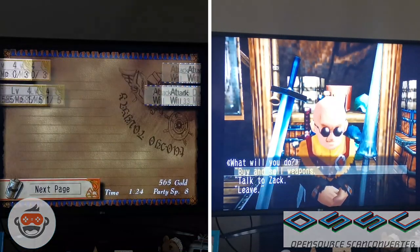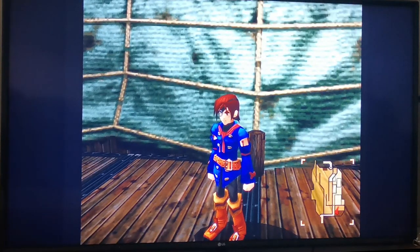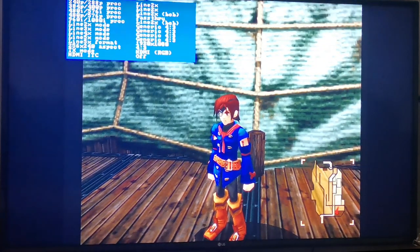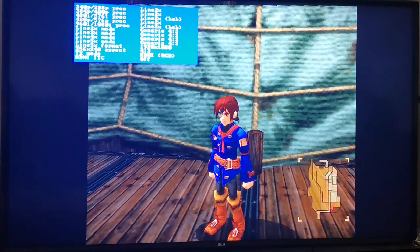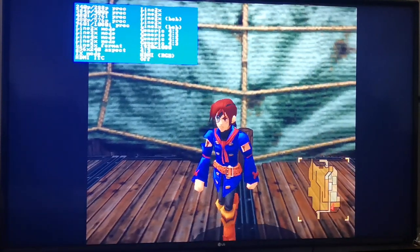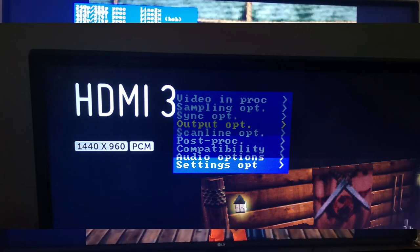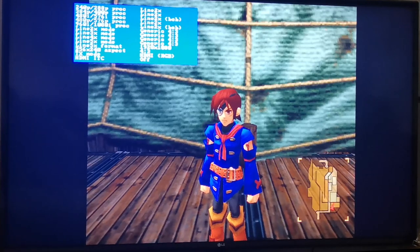And one thing also that the OSSC gives you is line doubler mode. Now this actually scales it to times 2 of the lines of information. If you're a bit confused by that, it's not upscaling the image, it's just kind of doubling the information. So hopefully you may notice this in the video, there's definitely more clarity within the textures of the game. The resolution does get bumped up to an obscure resolution, as I show you here, but that's not accepted by my capture card, so I won't be able to show you that.